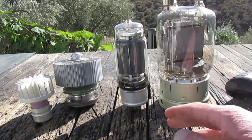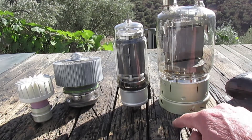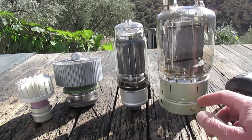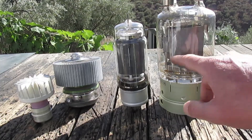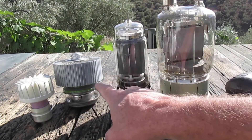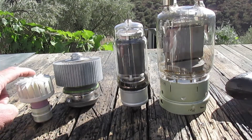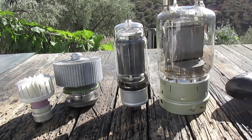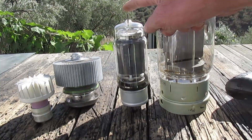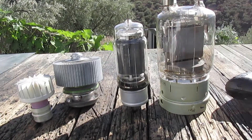What we're looking at here is a collection of old USSR thermionic valves. These tubes are high power amplifying tubes. This one's the GU81M, gives about 1,500 watts. This one will give 200 watts, this one over 1,000 watts. This little triode will give about 300 to 350 watts. One thing they've all got in common is that up on the anode of each device we need a high voltage.